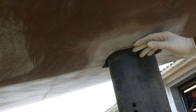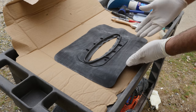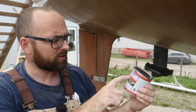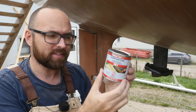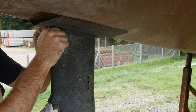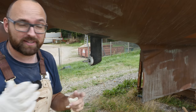The barrier coat is exposed but I don't think I've gone through it anywhere. I've lightly abraded the surface of the flappy bit and I think I'm going to put it in place on the sail drive before brushing on the contact adhesive. It does look like it's going to rain a little bit later today but if it could just not rain for 20 minutes we should be good. This stuff is called contact adhesive 281 — I'm pretty sure it's only available here in Denmark but in case you want to find something similar, this is a neoprene-based adhesive. I need to make sure this goes on perfect in the first try because once the two surfaces touch they're bonded forever. I think that turned out pretty well — I've always been a little bit afraid of contact adhesive because once it's on there it's on there, but this turned out okay.